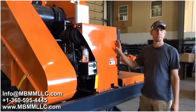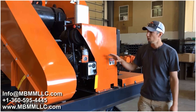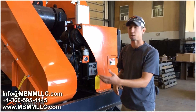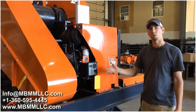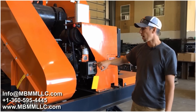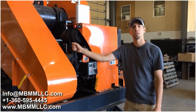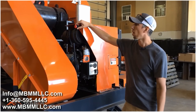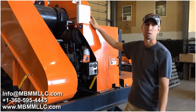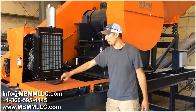This is about a 50 horsepower Perkins engine that runs this unit — it's a water-cooled, four-cylinder diesel. We've installed an over-center clutch so you can start the diesel, get the RPM where you like it, and then engage the jaw crusher. The starting procedure: you get the key going, you have the glow plugs. I like to start it up, get it to about 1,200 to 1,400 RPM, engage the jaw crusher, and then use the throttle to increase RPM until the jaw crusher is running about 275 to 300 RPM — on the engine RPM gauge that's about 2,000. Here's the fuel tank — it's a diesel tank, about 15 gallons.